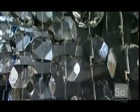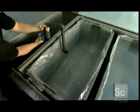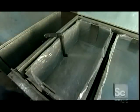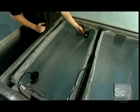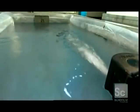But just how do they get this ice to be crystal clear? They start by tucking a plastic liner into a big tank and pipe filtered water into it. A worker places a measuring bar with a dipstick set at 10 inches — that's how thick the block of ice needs to be. He clamps electric submersible pumps on each end of the tank, positioning them underwater at a 45-degree angle. These pumps are key: they keep the water moving, forcing bubbles and impurities to the top while clear water below freezes.